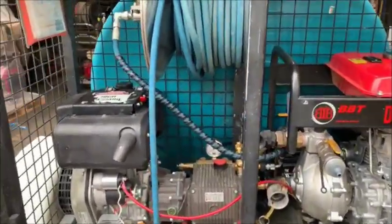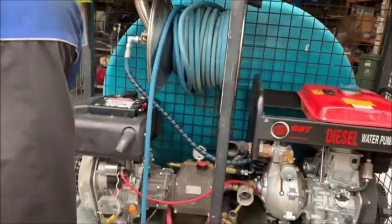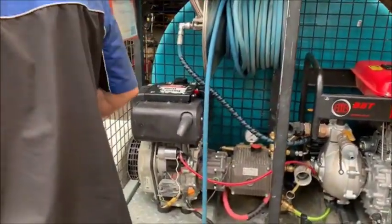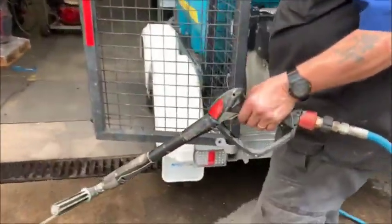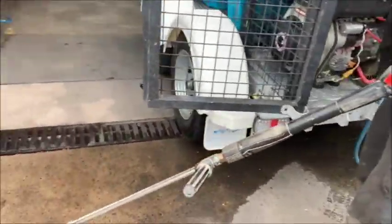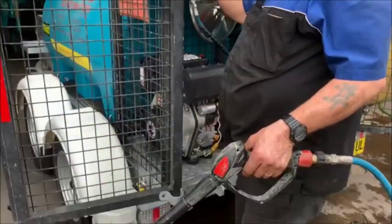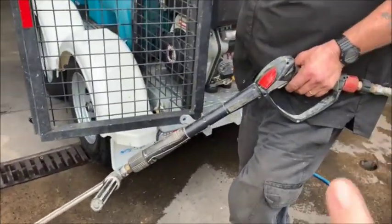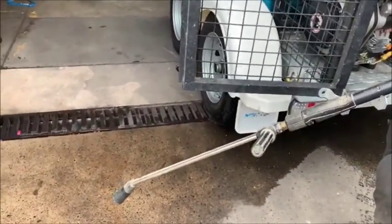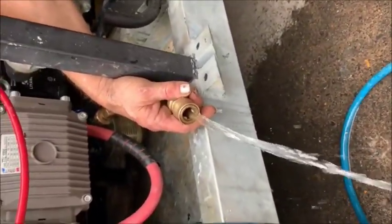So now we're running off the tank. You don't get any pressure coming out of the gun. Open the gun — we're going to open the gun but there's no flow, completely open. As you can see we've got a hand on the gun and water should actually be flowing through, just as a flow-through without pressure, but it's not doing that even with the gun completely open. This is all the water that's coming out of the hose when it's being gravity fed.